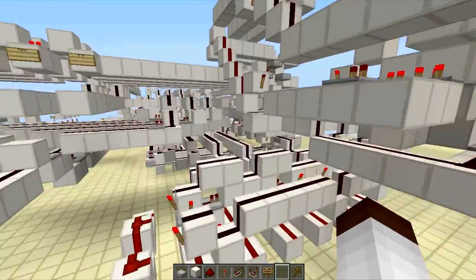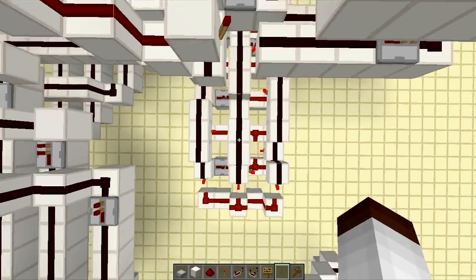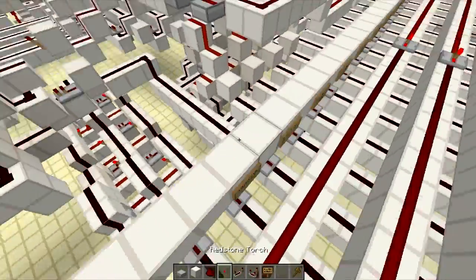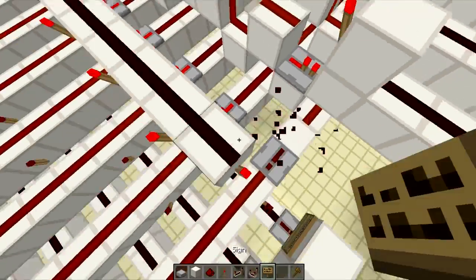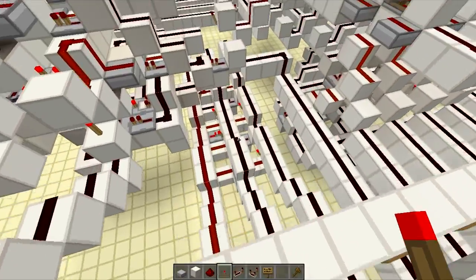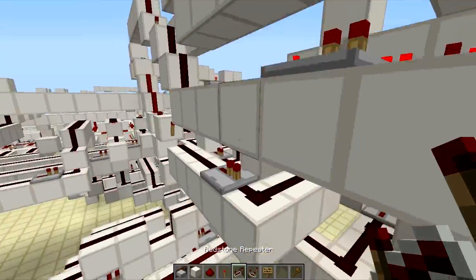So why I need this thing right here is basically an AND gate, so I can select which branching thing I want. Say, let's pretend one is if0, so I would go here and just say this line was on. Oops, let's put that there. Oh, this one, this is 4. So say 4 was if0. If if0 was on and this line was on, then it would branch basically.